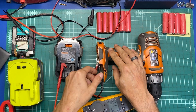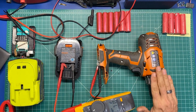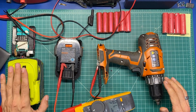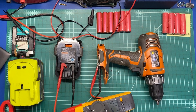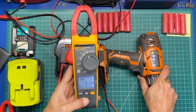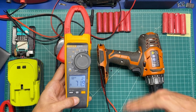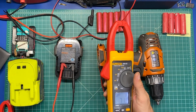71 amps. The drill actually did give on me — so the batteries are kicking out when it gets to a certain point, but it resets fast. It doesn't stay off until you put it on the charger like the Ryobi. So it does kick out somewhere around 70. That's a lot of power. 71.9 — let's just call it 72. So 72 amps on the chuck-down before the battery kicks out, then a momentary delay before you release the trigger and pull it back in again to get current flowing. Much higher than I thought. Much higher than I expected. Probably would go higher too.